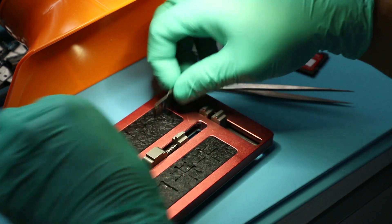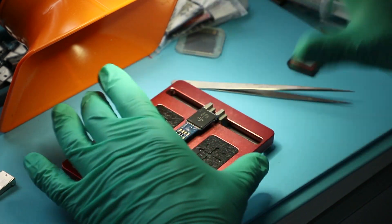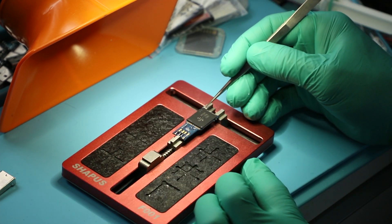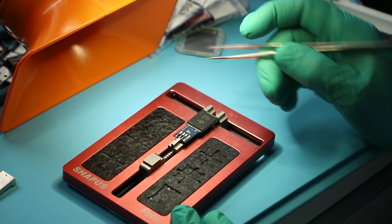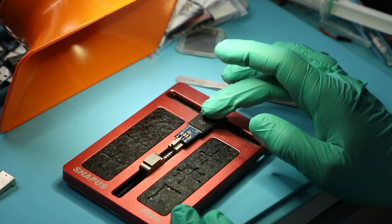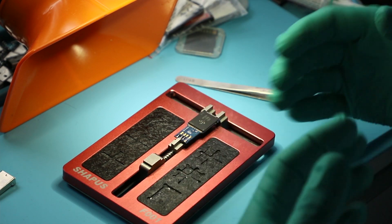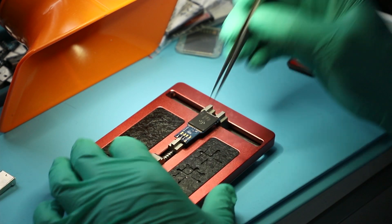With the connector removed, I'll mount it up in the jig this way. This is probably the optimal spot, because if we go sideways, the claws that hold the PCB in place may apply pressure to the chip. If we start heating up the chip while pressure is applied, some of the solder will melt first but some will take longer. When the bond between the chip and the board gets down to only a few pads, the force of that pressure may break them off — so that's very important to prevent from happening.